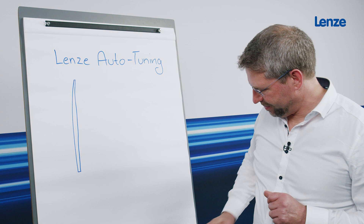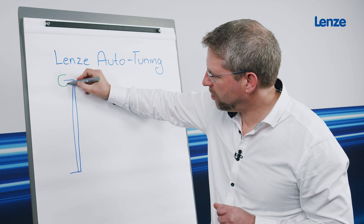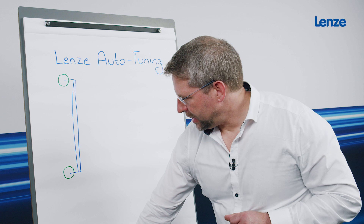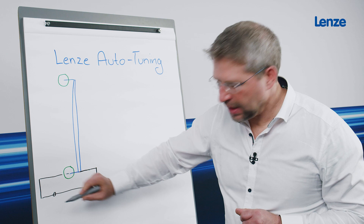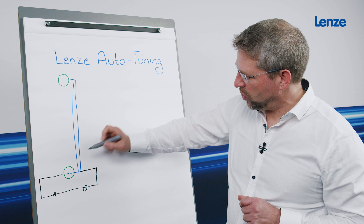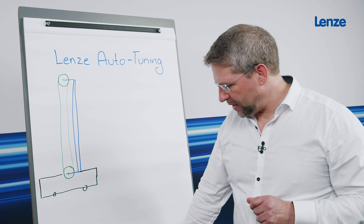It's usually pretty straight. At the top and at the bottom of the mast are two gear wheels — I draw them here in green. The mast is mounted on a vehicle. This vehicle can move back and forth in the alley, but we are now interested in the elevator, the up and down movement. There is a toothed belt for this, also in green. The load handling device is attached to the elevator, shown here in blue.